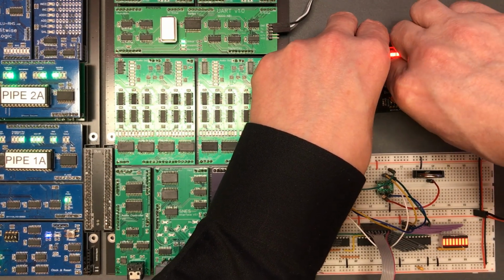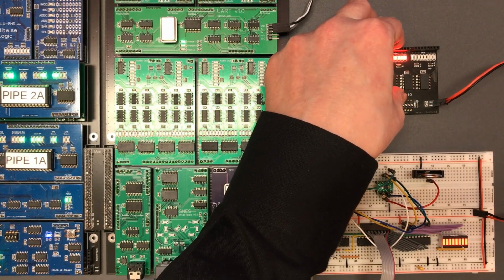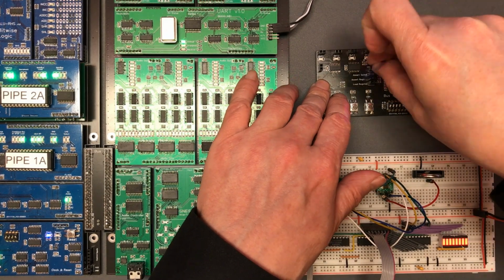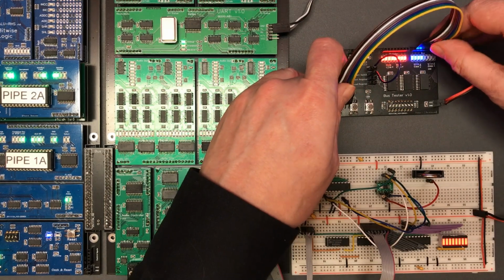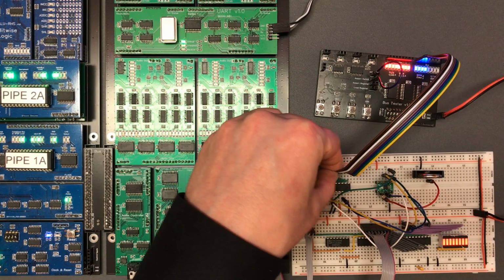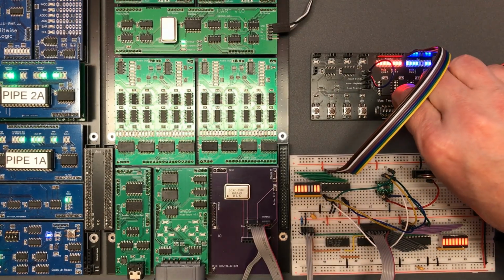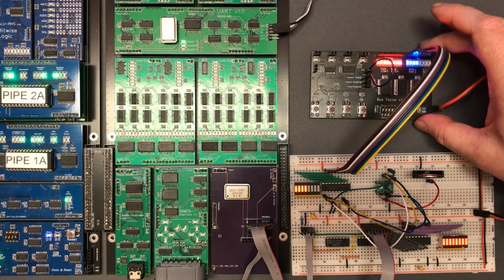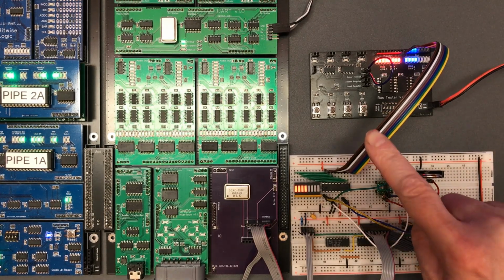So, setting the switches with the lower 4 bits low and the upper 4 bits high. Now you can see that on the output bus there. I think it's going to be very difficult to do this without occluding those output lines. So now we see them on the LED over here, so you can confirm these wires work. This circuit's just operating as a set of dip switches that are outputting onto this wire.